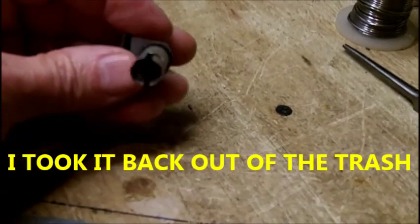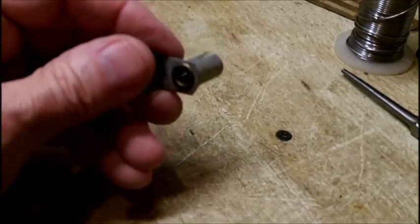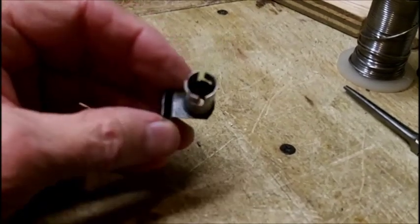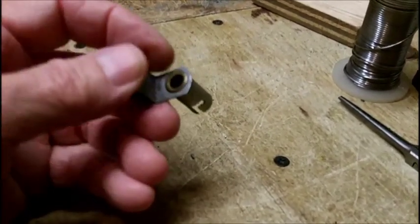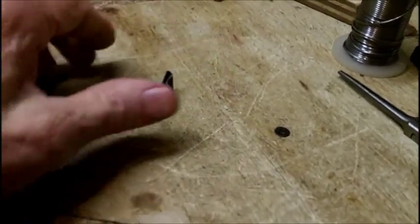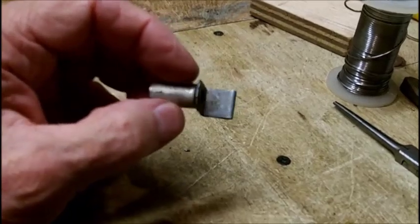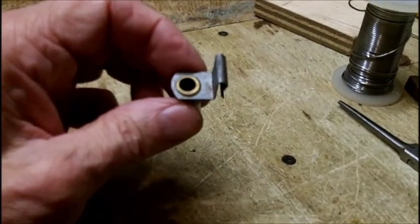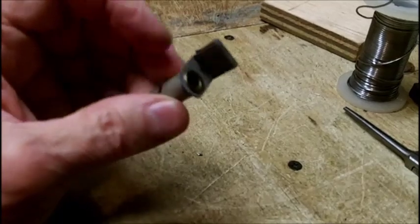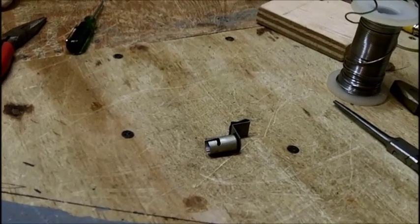All right, I tried to save this socket. The insides were all crapped up, there's a black plastic with a spring in there. I tried to redo it and tried to put a new wire in it. Couldn't do it. So I need this holder. I don't have anything like this at all in the shop. The only thing I can do is to bring in a 47 bulb, solder it in, because I don't want to throw this out. Put it in this shell and solder it in. All I can do. I'll do that off camera, and then I want to move on.